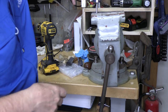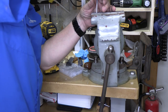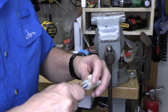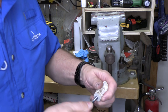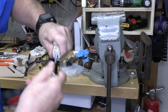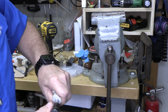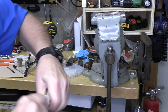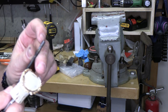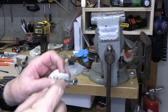This will undoubtedly make the threads a lot sharper and much more precise — yeah, it looks a lot cleaner. It goes in a lot better now. I might even drill this out just a little bit deeper so the tap goes all the way to the bottom, because this is not really a bottoming tap — the threads at the very tip aren't going to cut. So I'm going to deepen the hole a little bit and tap it in a little further.